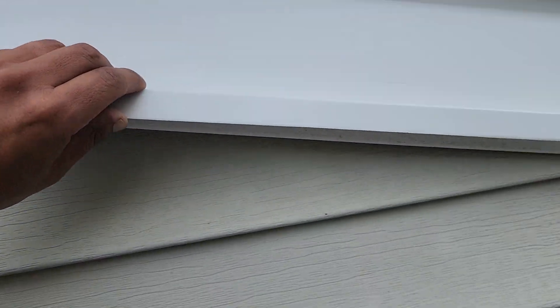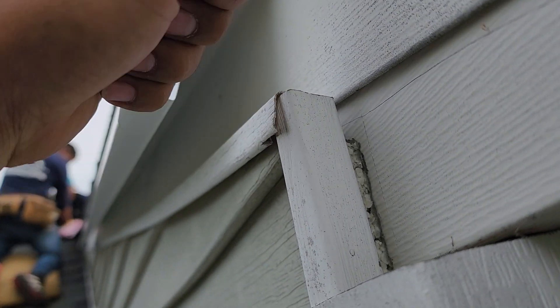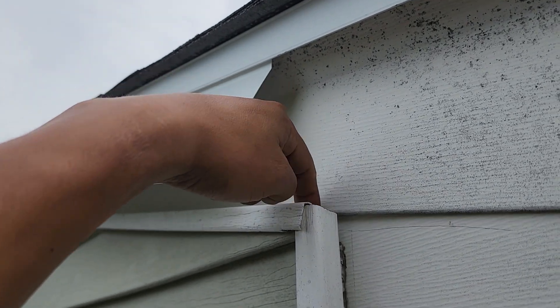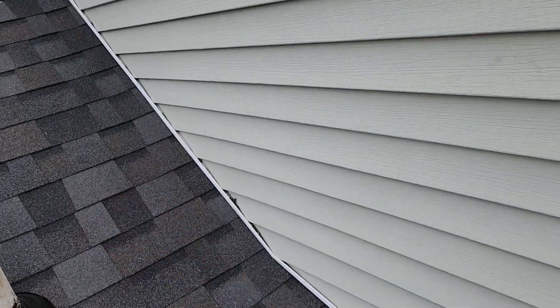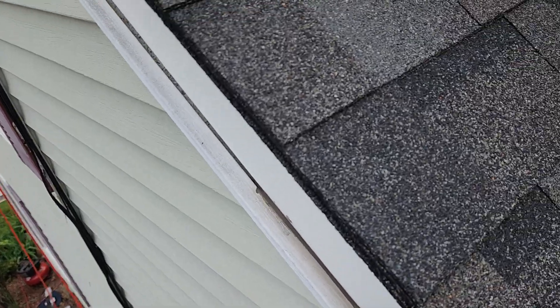So we added this metal right here. What's happening is water is going right behind the siding. You can see the rake board is right behind and the guard is popping out, so all the water is just coming through here — a lot of water. It was causing leaks all the way where the roof meets the wall, because everywhere it had been done the same way.